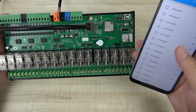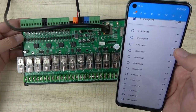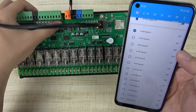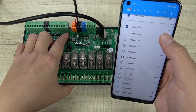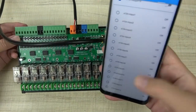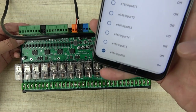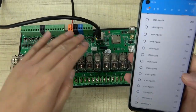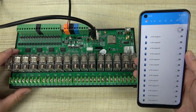You can also see the 16 channel input - the input state is now off. I can press this button - I hold on this button, this is channel one. If I hold on this button, channel one is on; channel two is on; channel three is on, and so on up to 16 channels. You can see I hold on and it's on - this can be used for Home Assistant trigger automation. This shows the input and output for the Home Assistant application integrated via ESPHome.